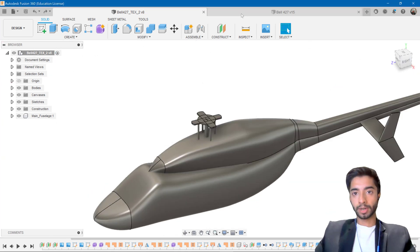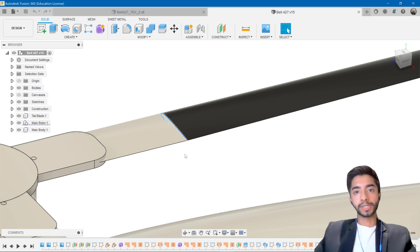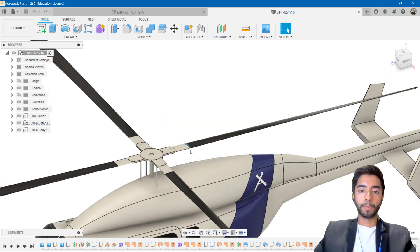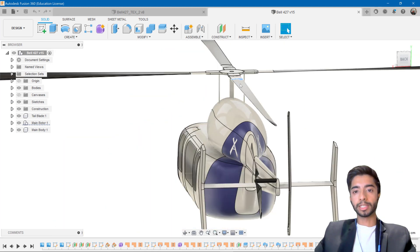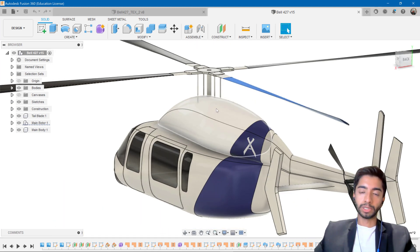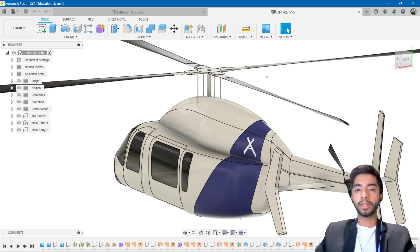The next thing we want to work on are the blades. In the previous model, you can see these blades are very simplified. What I've done is use one airfoil section whose chord is parallel to the ground plane, and then another airfoil section at an inclination — so the blade has a twist. This is more for visual purposes. If you know your airfoil design and aerodynamic design, with different twist at different span stations and different sweep angles, please do take that into account. But what I'm about to show you can be used as a first step.